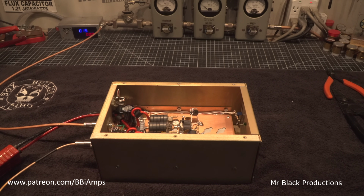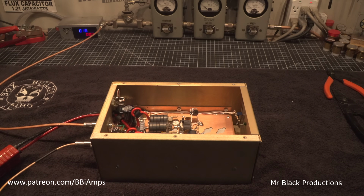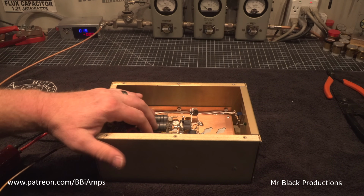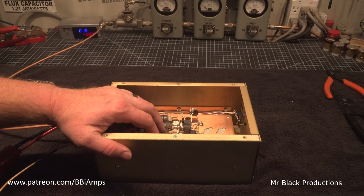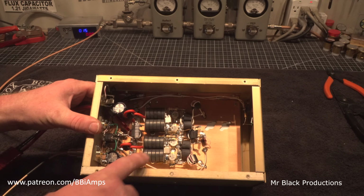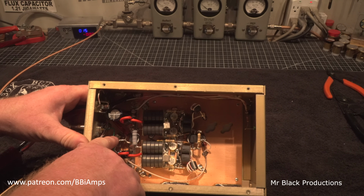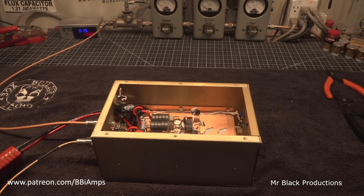We got rid of the 1000 puff that they had on the input transformers. We replaced them with type 61 outputs, the 5/8, and metal clad capacitors. And then we did a metal clad capacitor out here for the output tune and got rid of the little 150 that was in there that will probably break down, and that's the wrong capacitance value for these transistors these days.